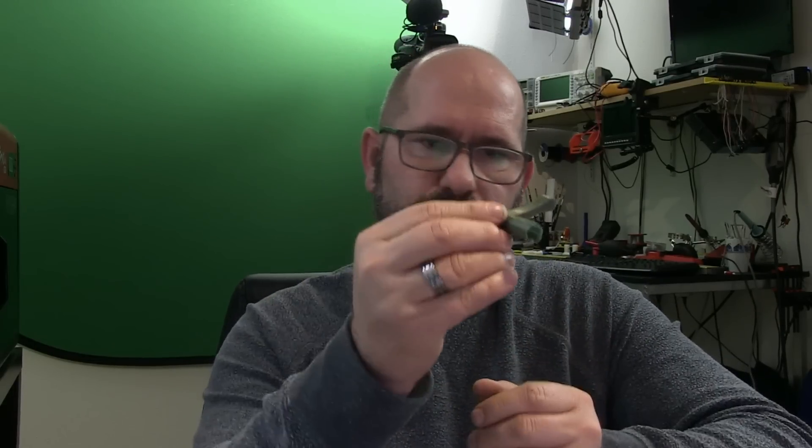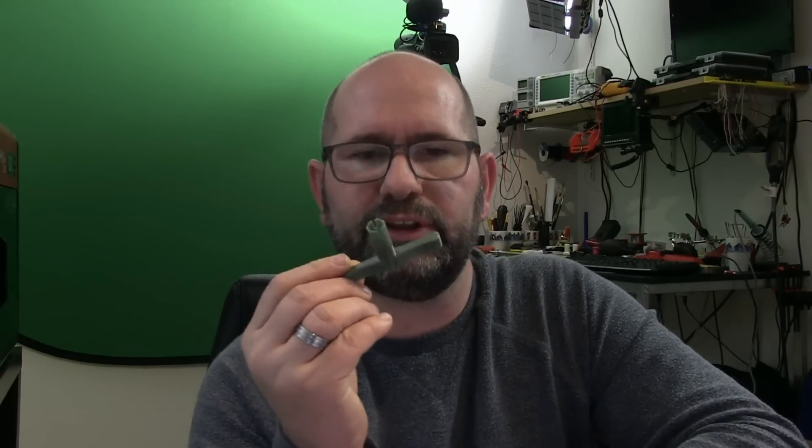Then I found this great tool, also on Thingiverse — link in the description. This tool helps you get the push fitting for the PTFE tube out the back of your printer. If you have a DaVinci Pro printer and want to change the push fitting where the PTFE tube comes out to guide the filament, you normally have to disassemble your complete printer just to get to that one nut. But with this very simple tool you can just push it in and screw it tight or loosen it without opening the whole printer.